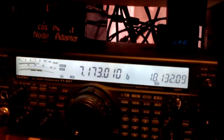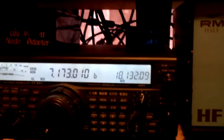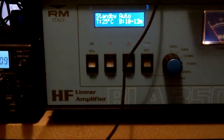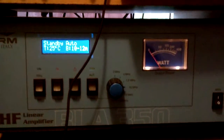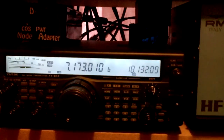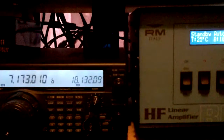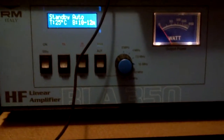You need to make sure your amp does eight watts or just below eight watts. You do need to make sure the radio is only doing eight watts. If you want to go up to 10 watts or 12 watts or whatever, and anything happens, it's down to you. RM Italy say 14 watts — I don't do that because if you do that you're going to blow the finals. So whatever it says in the manual, don't do it. Eight watts, no more than eight watts.